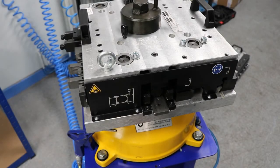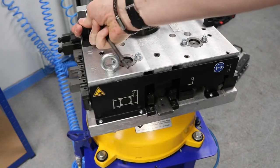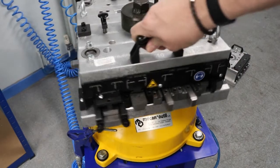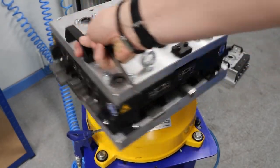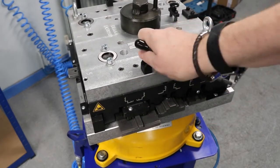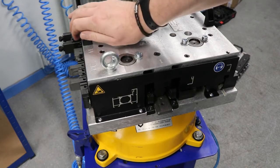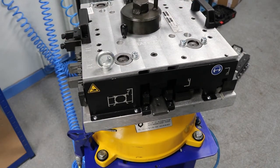This is punch tool two. As you can see, it's mainly used for notching out and preparing different sections of profile, so this takes a lot of work out of the finer things in the profiling rather than doing it by hand. You can see all the sections it actually does. The first thing we're going to do today with this punch tool is take out the shoot bolt section on the sash profile.